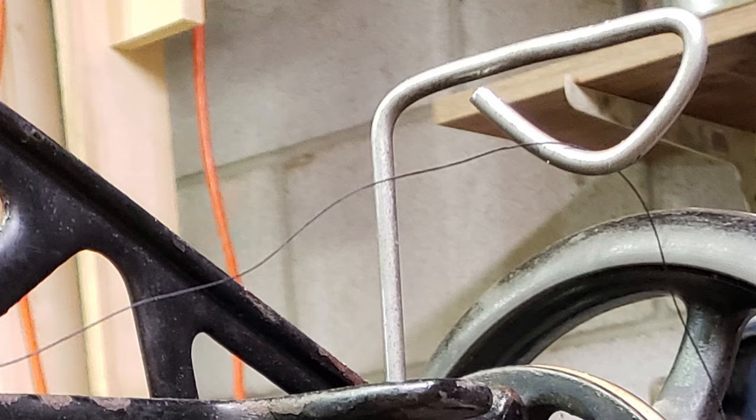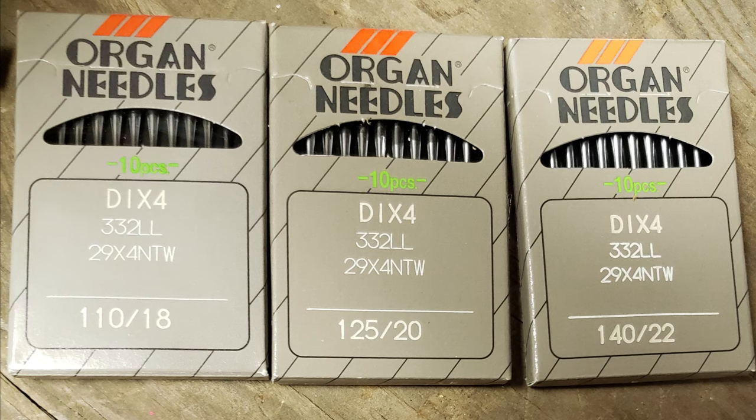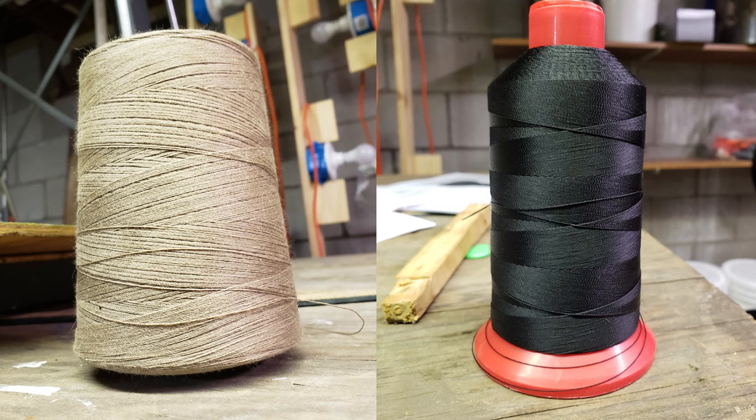After all that, I gave it an extra amount of lubrication and found that the sewing machine was skipping stitches. The shuttle was a little sloppy and slightly worn, so I bought a new one for the 29K. The new shuttle worked fine without any modifications, but it didn't solve the problem. I tried several combinations of needles and threads and finally found one that worked — the machine stopped skipping stitches.